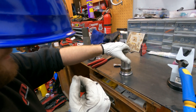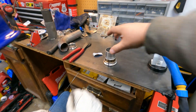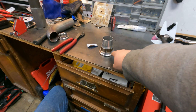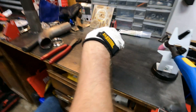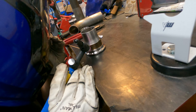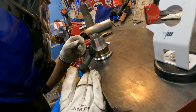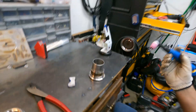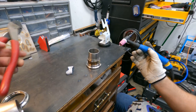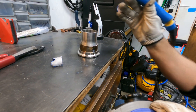Got a little bit of a clearance issue, but the weld will take care of that — nothing a weld can't fill. Second tack on there. Hell yeah, now to tack the V-band. I can see the bend in that pipe creating a little dent from where we clamped it, but that's fine. That was annoying — the problem with this welder, like I've mentioned so many times, is it's a scratch start and a really shitty scratch start, so it literally just arcs immediately as you touch it.